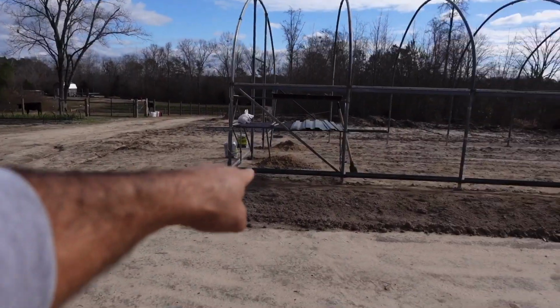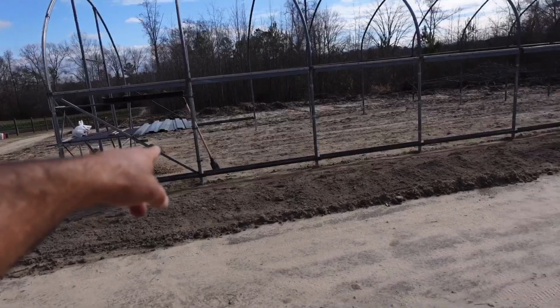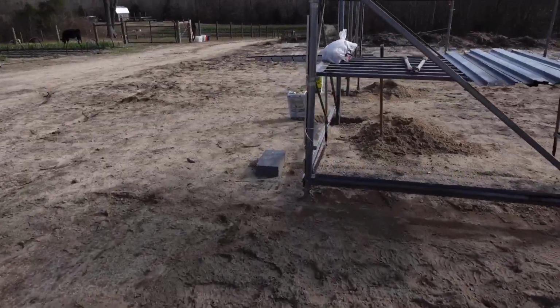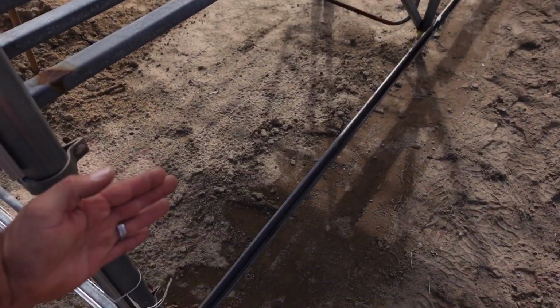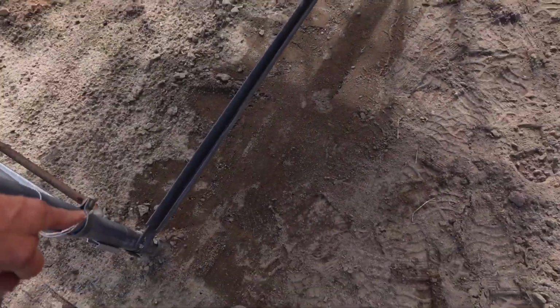But anyway, we're basically gonna go down the whole exterior all the way around with these 2x6s, and make basically a seal for the bottom. And that does two things. It'll tighten up all the play in here, but also it'll give us something to set those polycarbonate panels on top of. And probably what I'll do is wind up taking these tracks apart and using this piece here to keep the panels from moving in and out.